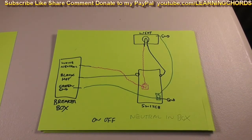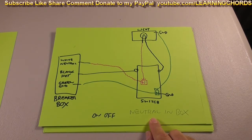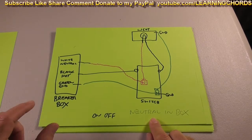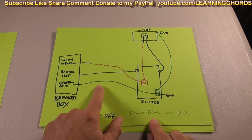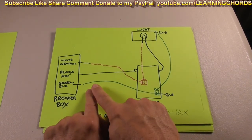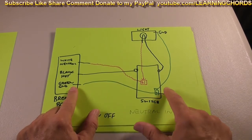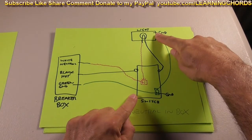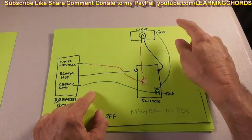This is the circuit that you are going to be interested in if you are wiring up a smart switch, because they will always say must have the neutral in the box. And it depends on how the house was wired, and if they put the neutral in the box or not. Normally, if things are working the right way, and ground, I'm not going to get so much into ground, but you should always have a ground. Ground is going to go from the breaker box, into your switch box, over to your light box, so we'll just assume that we have a connection of ground all the way through.